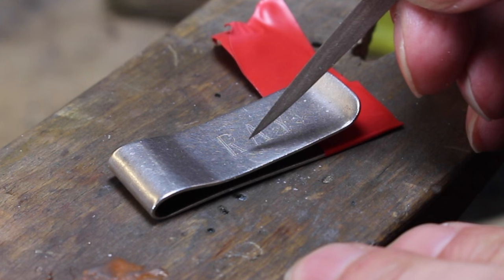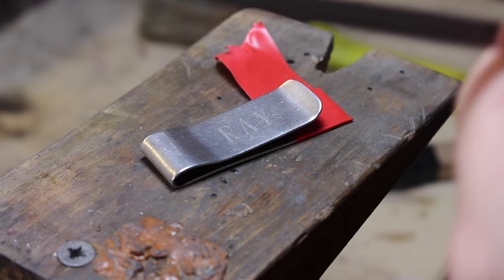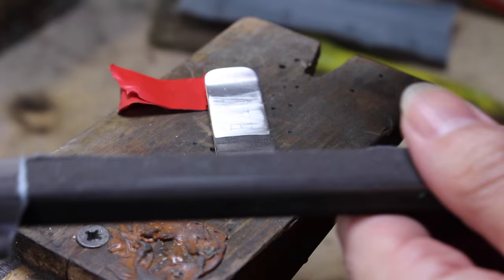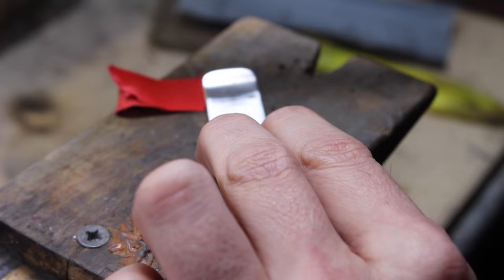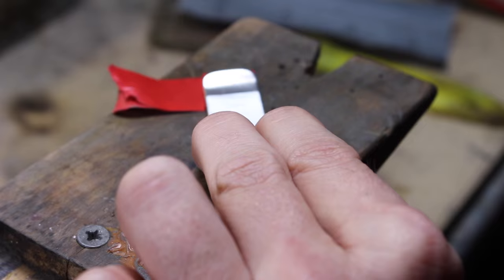This is why I said earlier you have to watch out for deep spots at the corners, but this is nice and easy. What do we use? Well, we need something flat. You can use a flat file — this is a diamond file, I think this is 600 — or I've got some 500 emery paper. Whether you're using a file or an emery stick, it's important that you use something that's straight. You don't want anything curved — a nice flat object, a flat file or a flat emery stick. So just working away there. I can see that starting to cut into the surface now, so it shouldn't take too long. I'll take it to halfway and then give you a look.